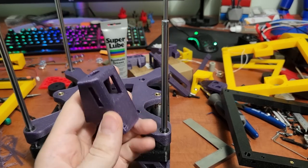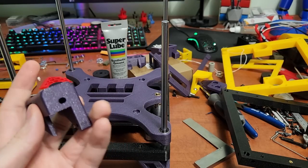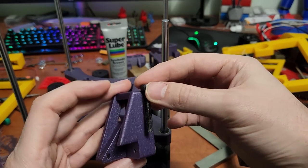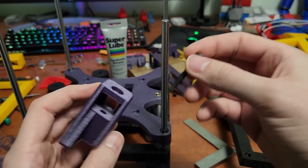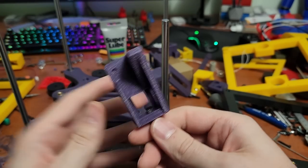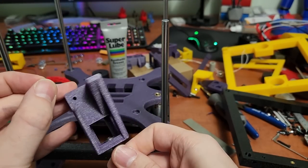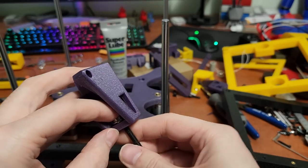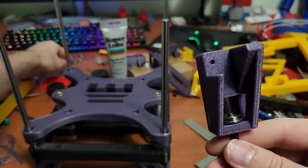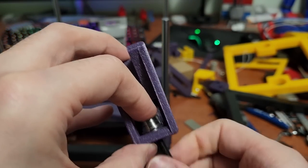For the front idler towers, I've made a slight modification so everything lines up nicely. The hole goes all the way through — I'm using an M5 by 30 bolt. Generally what I do is tip it upside down, thread the bolt in just a little bit, put an M5 washer on first, then set a bearing on. There are actually two bearing stacks that sit on here. The M5 bolt holds everything together and it's manageable — just take your time.